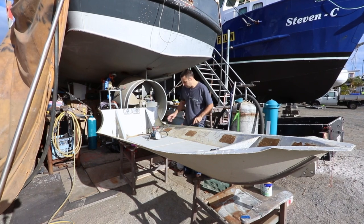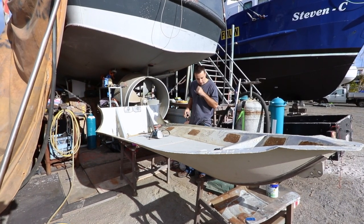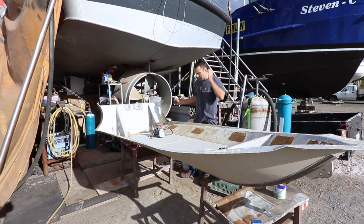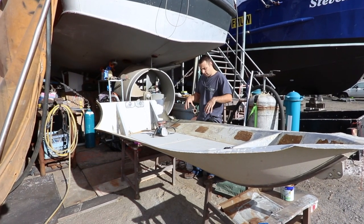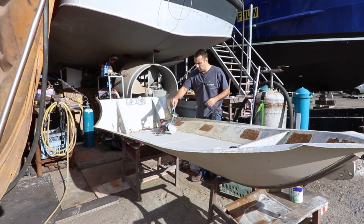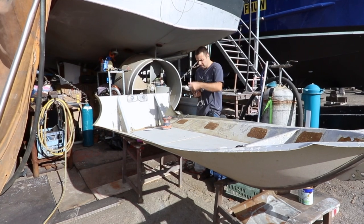So what my plan is, I've got 40 grit. I'm going to rip it up with 40 grit, take the surface off, and then I'm going to put more paint stripper on, and I'm going to lay glad wrap or like a plastic wrap over top of it to try and keep the stuff that's in the paint stripper from evaporating out, basically. So a few people in the comments told me to do that, so get into it, see if ripping the surface off helped.